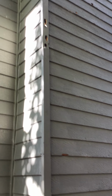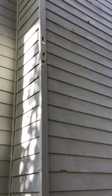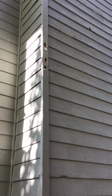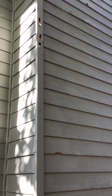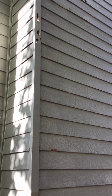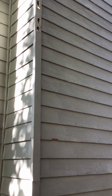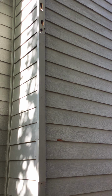And the key to it, you can use whitewood, which is what this is, instead of pressure treated, which takes time to cure. You just have to back prime and seal all the edges. When we come back on this job to do this for Keith and his wife, when we pull this corner board off, you'll see that they only painted what you see, which are the two faces, the left and the right. But on any piece of wood, there's actually 6 sides: the bottom, the top, and the 4 sides of the rectangular square. If you back prime and seal all that stuff, it'll never rot.